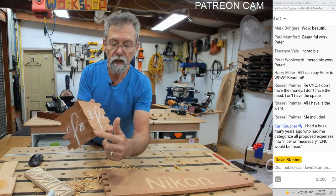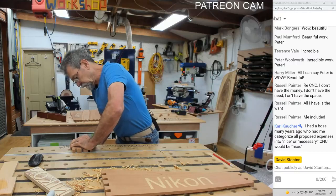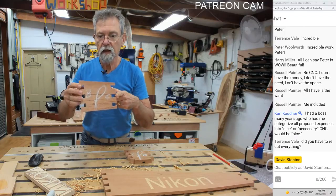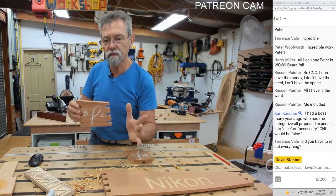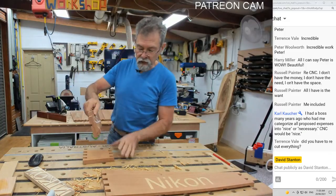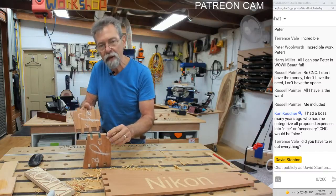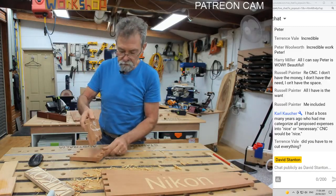Now you can see that all works, and we'll even try in a minute, take that out, and working on the C joint this time. This is the C section. Now, I didn't have to recut everything at all. It was all fine, but as I said, I fluked it. So I'm going to put it to the outside. So remember, we've got that and that are the outside with the face mark facing down to the base of the box, not up to the tapered section.